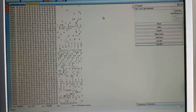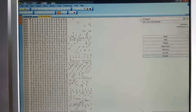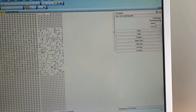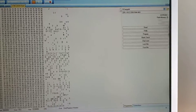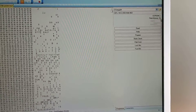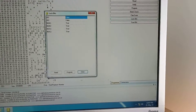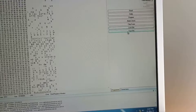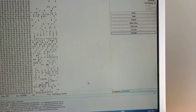I have the dump ready here — I've put everything here. You have the EEPROM and you must not forget to select it from here: EEPROM. Then you have the flash, and same thing — don't forget to select the flash. On the flash, you should select the fuse bytes. This is most important.